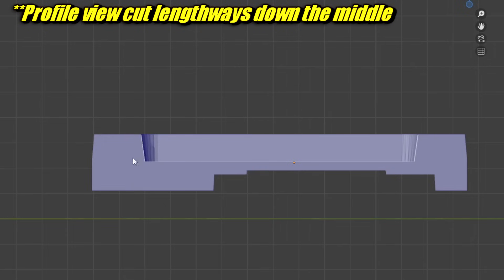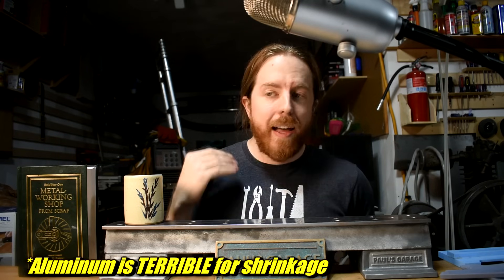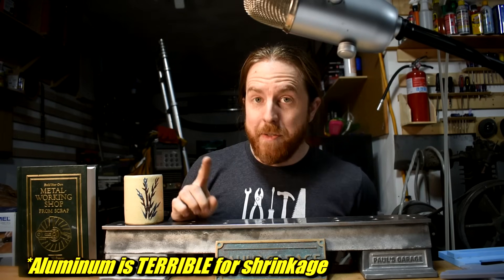One way to reduce shrinkage is to not have a really thick, chunky spot alongside thin spots all over. The thickest spot usually solidifies last, and that's where you get all your shrinkage. I took the thickest, meatiest spot and removed some of the thickness. I wanted to do more, but this part has to have holes drilled in it and bolts put through, so I couldn't go crazy. My goal was to see if removing some mass, pouring a better metal at a better temperature, and not using a feeder would work. If we don't experiment, how are we going to learn?